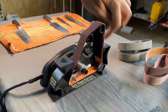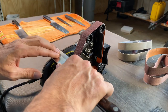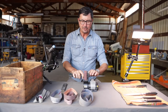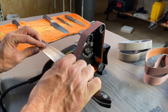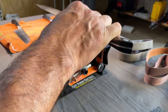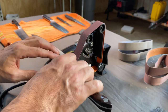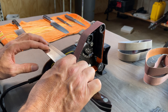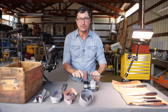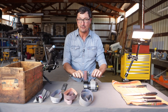When we changed that angle, it set us at 20 degrees. What we have here is a little flat plane — a little aid to help you start off on the right foot. Most of us can hold something flat, but very few of us can get those angles right. That's what messes us up on the stone. So this is just a quick reference. Once we turn it on, we're only going to make six passes and that's it — six passes to sharpen a knife from useless to razor sharp.